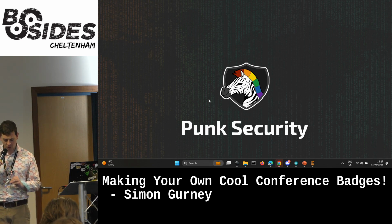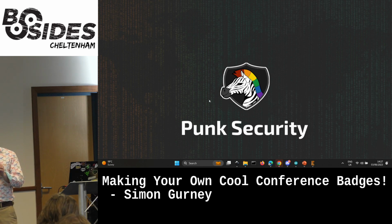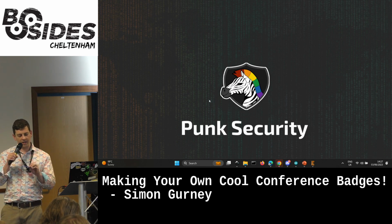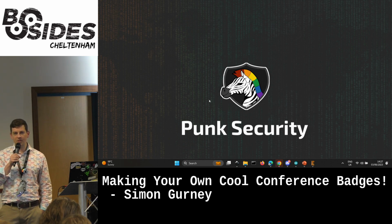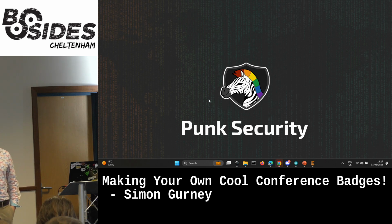The other thing we tried a lot with the DeLorean is changing the thickness of the board. There's a 0.6 mm, a 1 mm, a 1.2, and a 1.6 mm. Everything I've done before was 1.6, but I wanted the colours to reproduce slightly better on that bottom rail, so I went for a thinner board. I went too thin, and then you don't get the diffusion of the headlights. You end up in this really weird cycle of things looking terrible until they look passable. So that's probably the trickiest part of the DeLorean: how do we get the bottom bar to light up in a passable way.